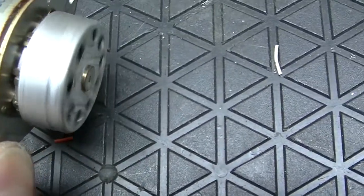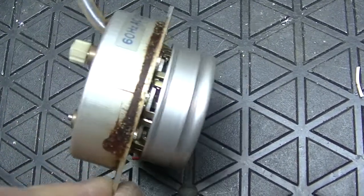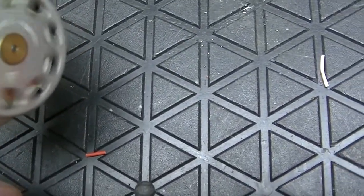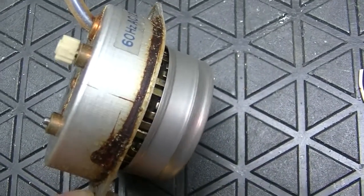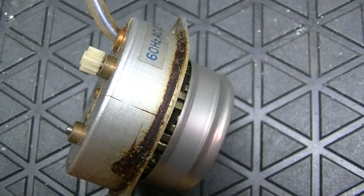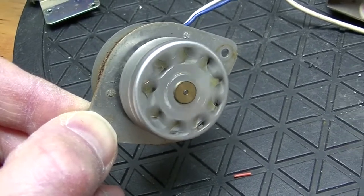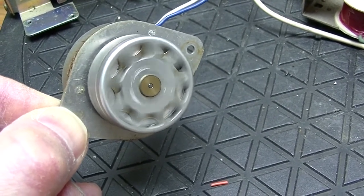Here's the motor powered up. That is the 120-volt, 60-hertz motor. At the back is the rotor and I might be able to lubricate a little bit in there, but the front part is a sealed unit which gears down the high speed to about one RPM. There's not much I can do except perhaps lubricate the spindle where the gear is. It wasn't sounding too good at first, but now after putting some lubricant in it's going much more smoothly and much more quietly — the bearings must have been really dry.